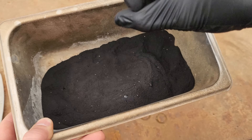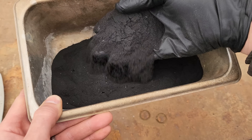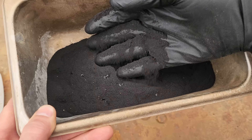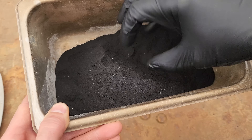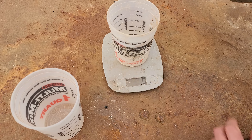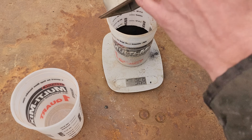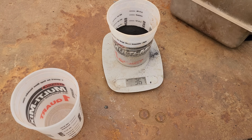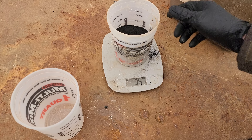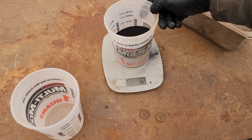My hope is - and this is the experiment, this is the whole point of the video - can I take these, smelt them down with a little bit more flux, and are all the sulfides converted into oxides so that all of our metal ends up in the bottom of the cone mold? Let's see how much we're starting with here. There's probably a lot of oxygen weight or water weight in here. The volume increased a huge amount - 367 grams. So we've got a whole bunch of material, and I'm going to need a bigger crucible than we used last time.